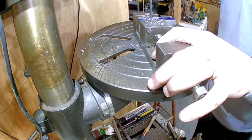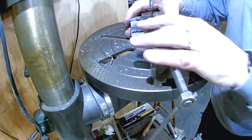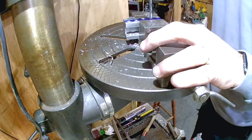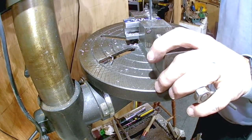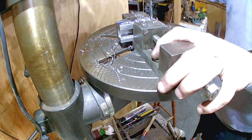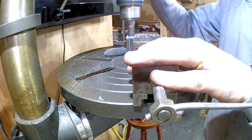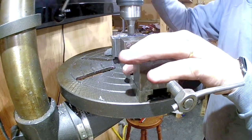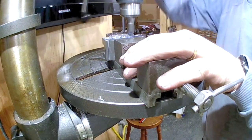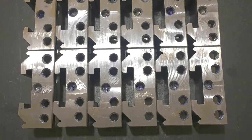Using a punch to indicate permanently where each of the 8mm tapped holes are going to go, I use my drill press to make the 5 tapping holes in each tool holder. Before tapping each hole, a countersunk tool is used to assist the tapping operation without leaving a burr on the top. Here are all 12 tool holders drilled and tapped to 8mm thread.